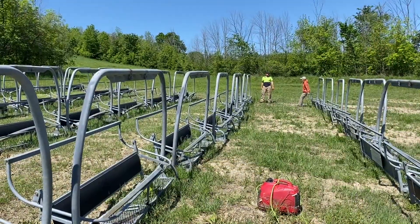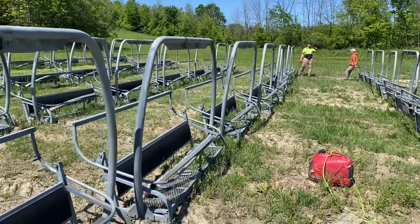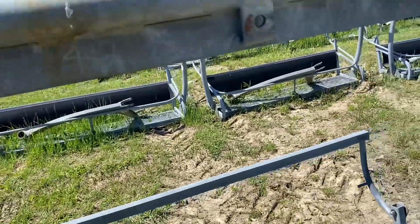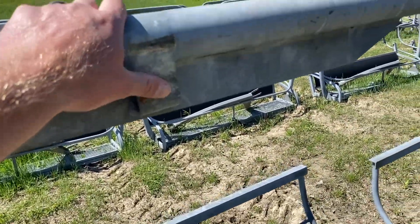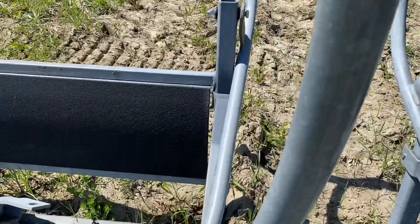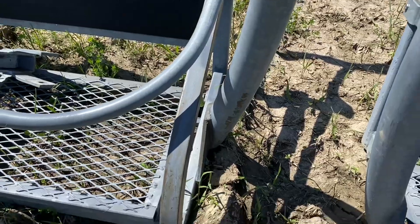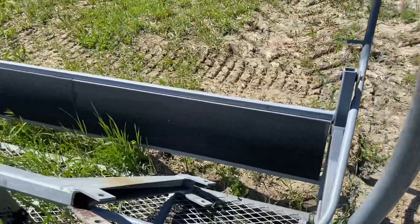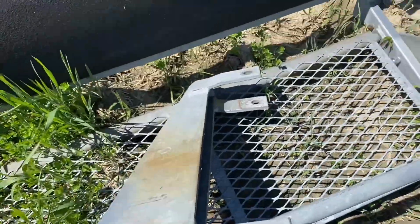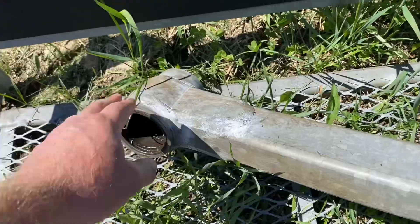Here we are doing 100% of the old BM carriers. What we're looking for here is welds in the corners, cross welds where the hanger arms mount through, and then coming down any of the welds on the back. Then where the bail arm comes down and meets the seat pad, and of course doing the hanger arm, double checking these tabs, and then the wrapping around the barrel where the grip goes through.